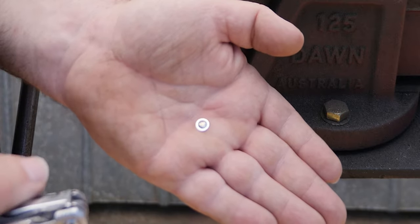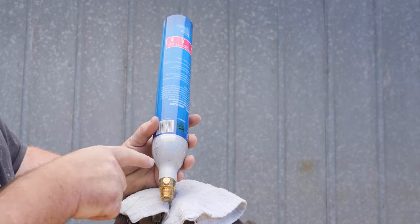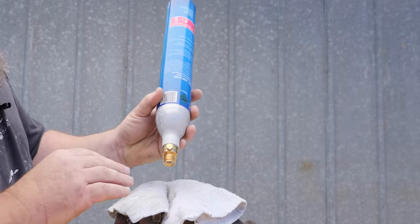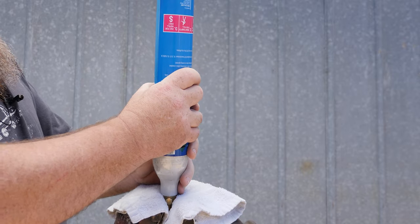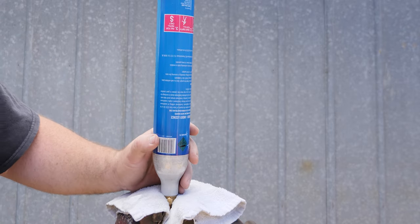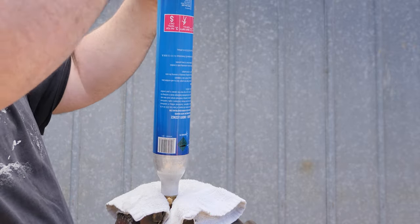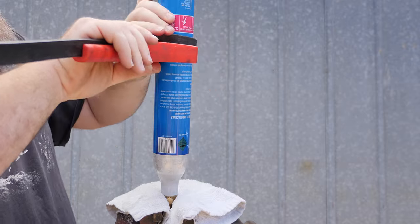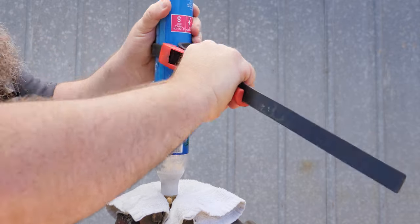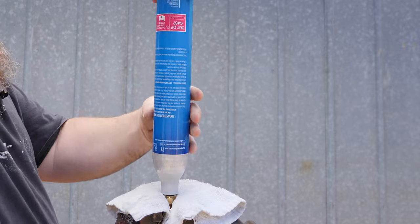Now we know it's fully depressurized. I've tried a variety of ways of getting this valve assembly out of the cylinder and this one works for me. A bit of rag inside your vise, bung it down, screw back in the burst valve assembly, grab your filter wrench tool, put it on the right way, cinch it down, and just undo it.